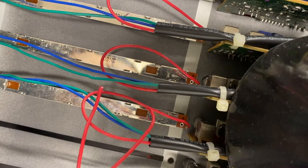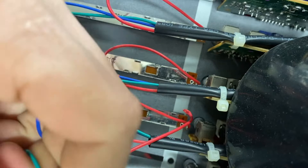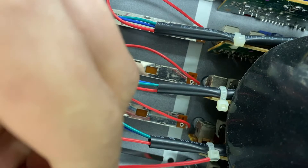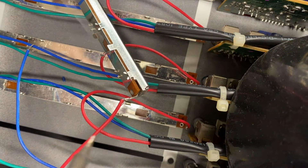It's kind of hard to do this with one hand, but boom, done. Now I'm going to come in here and strip this back, making sure not to yank too hard on the wires upstream of where we're working. We want to leave enough wire that we can fold it through like they had done originally — the best repair is one that doesn't look like it was actually completed. Now we're going to take our end, fold it through, and then solder it.